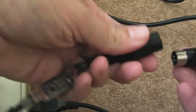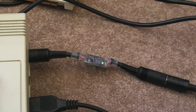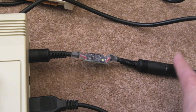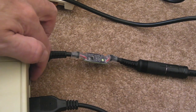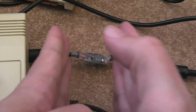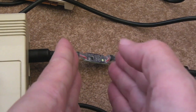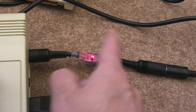I'll carefully reassemble this and give it a try. Having changed that cap, I've also made some progress speaking to Hans about this over several messages over the last day. There are a few things at play here. Interestingly, the 5.3 volt issue — it wasn't anticipated that there'd be a problem with switch bounce on 5.3 volt power supplies. But this does seem to be the case; you always get the switch bounce. I think in this particular revision, the hysteresis is a narrow window of tolerance that can shift when it's first switched on — the voltage is moving up or moving down.